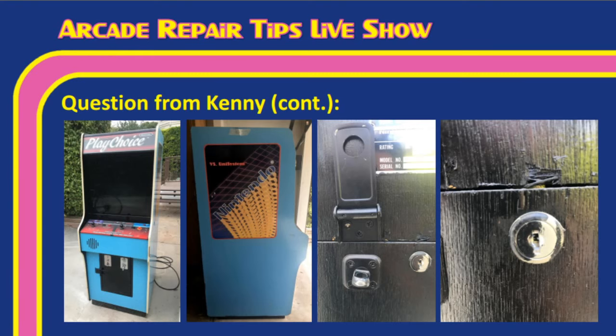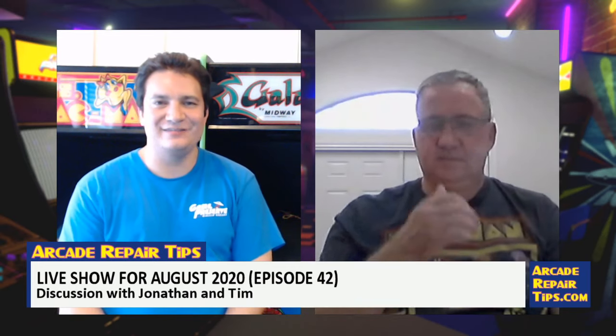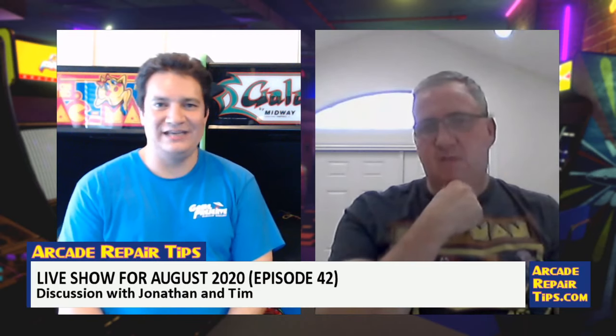So, Tim, Kenny has this really nice Nintendo PlayChoice, but he doesn't have a key for it. That presents a problem, especially if you need to work on the game at any time. So what can Kenny do in order to gain access to his Nintendo Vs. cabinet? Well, we've had a lot of luck with that particular one. In fact, the one we probably broke into, we got into by kind of prying it open from the back and then using a rubber hammer and hitting the end of the screwdriver to bend the cam enough to let the door fall open.